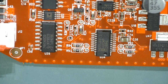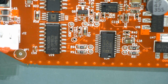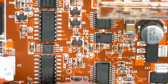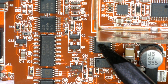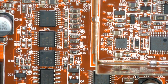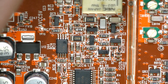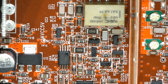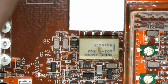And moving on from that, what do we got here? We're entering our trigger section of the board. ADCMP, I think that's just a comparator, and 74HC4053, got to have some 4000 series CMOS in there, no worries. Classic 595 again, 74HC4051, oh, it's all happening, all Jelly Bean stuff. Anyway, this is the trigger section, some local regulation across there, analog VCC's got its own separate 5 volts, and nice little test points all labelled, and that's the interface.